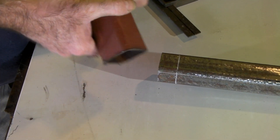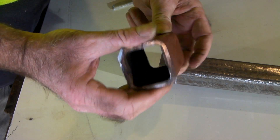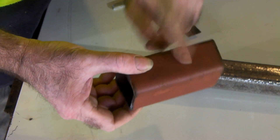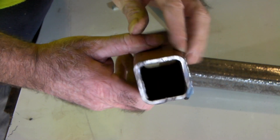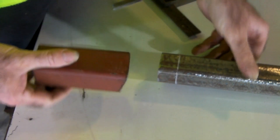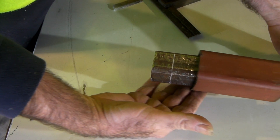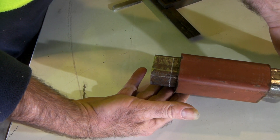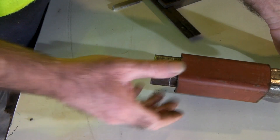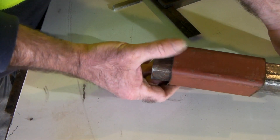See if you can find a piece of box section — round square pipe, whatever you like to call it. We call it box section here in New Zealand. Get a short piece that's got a square end on it so it slides over whatever you're trying to cut. You wouldn't make one of these guides if you're only cutting one piece, but if you've got several pieces to cut at different lengths it's worth investing 10 minutes to make one.